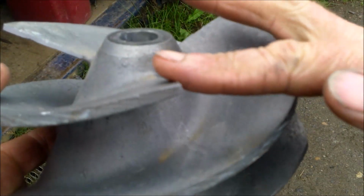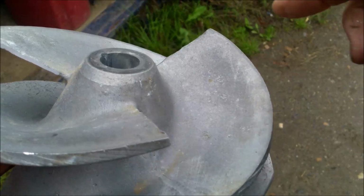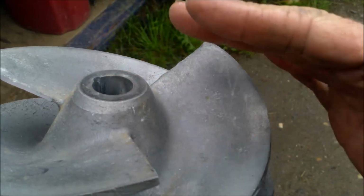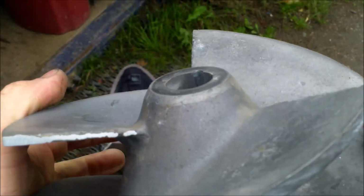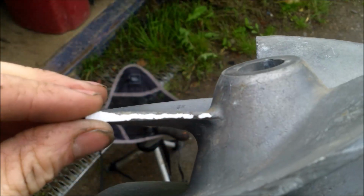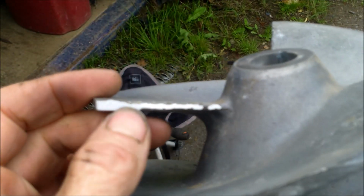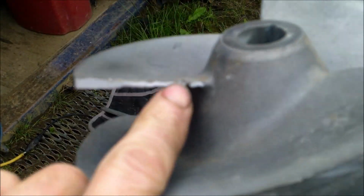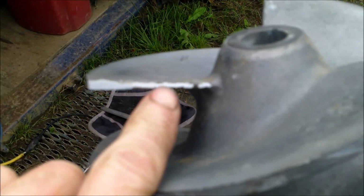I'm going to make that angle with the flap disc. Of course, if you don't have to touch it too much, you can do it with a file, but in this case, if you look at the size I have here, it's really big. And we have to go here. So we have to angle that blade like this, and on the front we need 1/32.